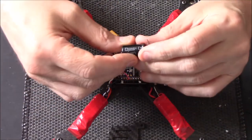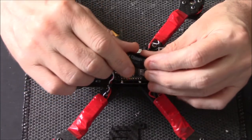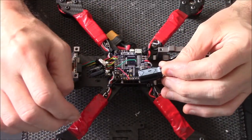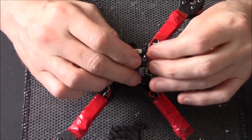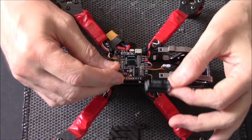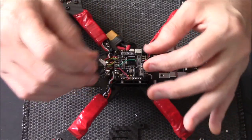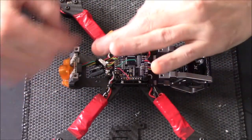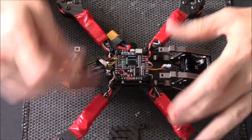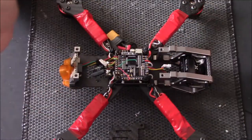This is a big capacitor, but if you're not sure about capacitors I'll leave a link in the description. To make it simple, they help cut down on what's called noise on the FPV camera — the bit of static you get. You get all different sizes, all the same shape, and you basically solder them onto the black and red of your LiPo cable. Some people get small ones and solder them onto every single ESC, but it's one of those optional things. I put a capacitor in anyway.